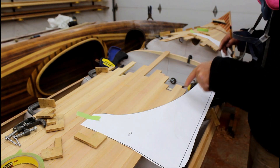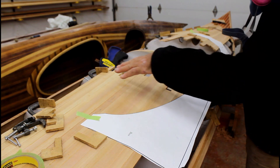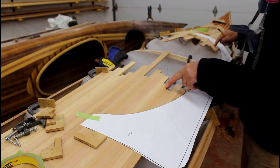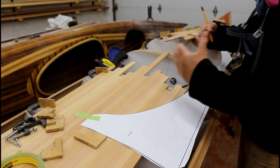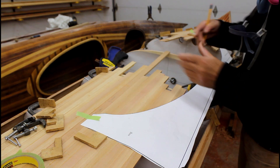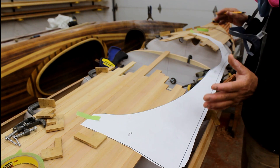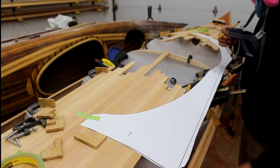Eventually I'm going to need to run a strip right through the whole thing here. The difference, of course, is that the circumference over this form is a little bit less than the circumference over this form. So as much as we are filling from the center line out, they're starting to become a little bit askew because of the difference in circumference and the number of strips to fill this area versus that area. I'm going to pay attention to that, and I might have to make a few strips that are slightly tapered to bring the angles back in line.